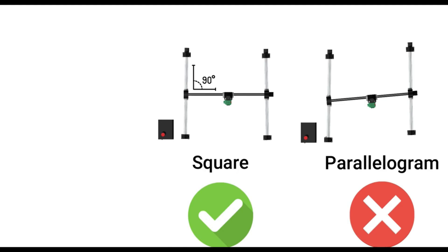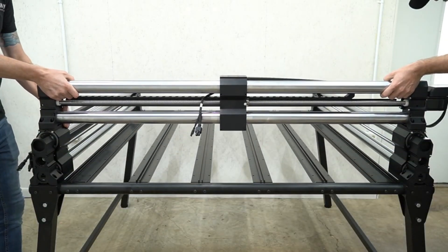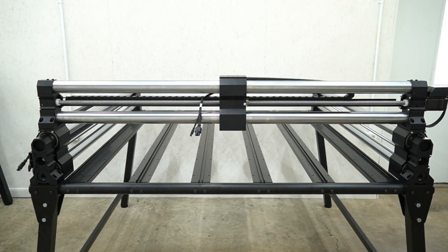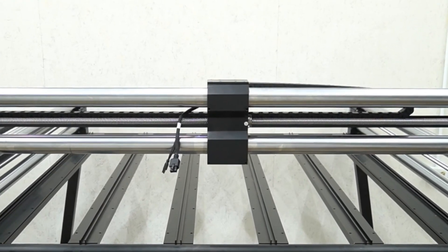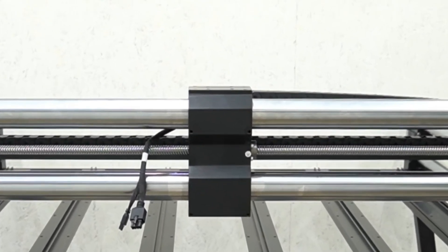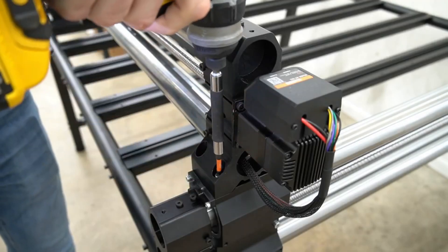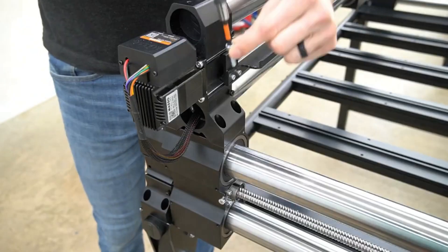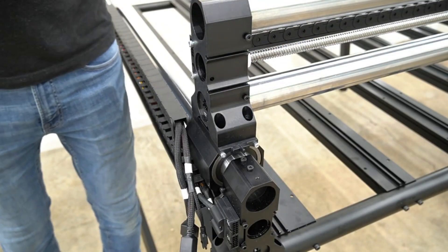It's very important to make sure that your machine is squared. If you set it up in the trapezoid or parallelogram formations shown, your machine will bind when it gets to certain areas. After placing our Y and B rails on our table, we can now place our X-rail on top, making sure that we index the feet of the X-rail with the gantries of the Y and B rails. It's important to note that unlike the Y rails, the X axis has a flat top so that the homing trigger can be mounted. Once everything is aligned correctly, we'll use the X-rail mounting bolts to secure this in place, making sure the X-rail stays square to both the Y and B rails.